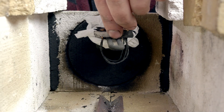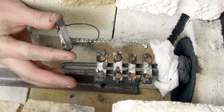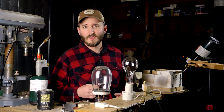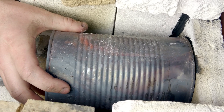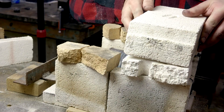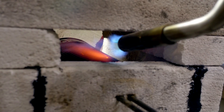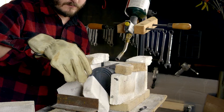One thing that Edison discovered rather quickly is that the conductivity of a filament made from pure natural fibers was very low, so it had to be helped along by smearing the material before carbonization with some of the same carbon soot and tar putty. That's what I've done to this paper towel. I've made my carbonizing chamber so that I can produce about half a dozen test filaments at a time. They're placed upside down on a supporting wire, and some sacrificial pieces of paper are placed in the chamber with them — so if any oxygen gets in during heating, hopefully the paper will react with it before it has a chance to damage the filaments. I use a large soup can as the actual carbonizing chamber, and I found that spraying the inside with rubbing alcohol also helped to improve the quality of the filaments by reacting with the oxygen that would otherwise damage them. The heating process takes about 10 or 15 minutes, then just as long to cool down before I can safely open the chamber.